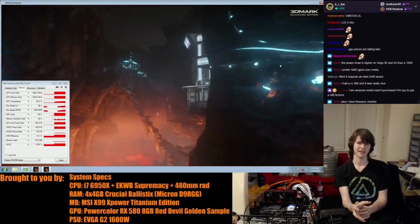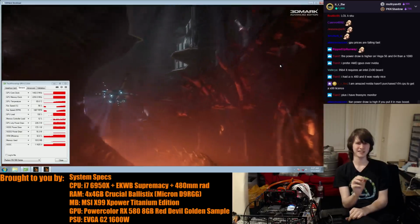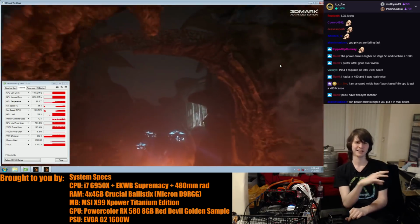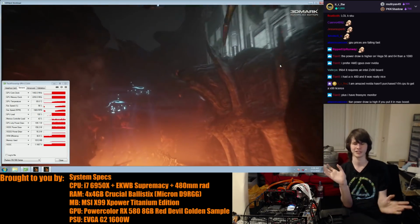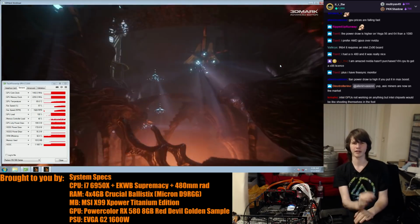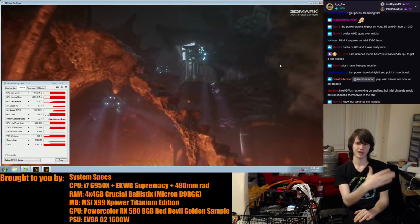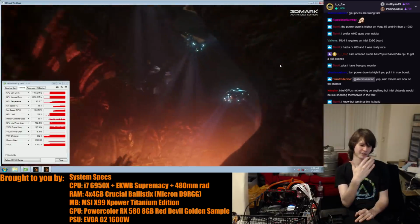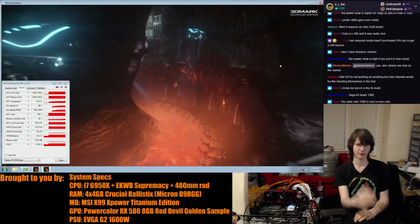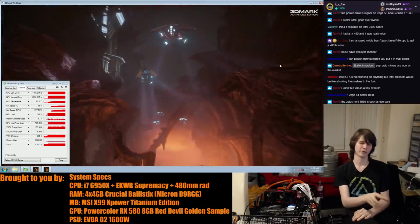And then even the sockets: Intel CPU sockets get dedicated pins for voltages like VCC PLL_OC. That voltage doesn't need to exist from Intel's perspective. If they didn't care about overclocking, that voltage doesn't need to be a thing at all. But Intel's like, yeah, we're gonna support extreme overclocking, so they made that voltage a thing. Because if you're on liquid nitrogen and you don't have that voltage, you get Kaby Lake cold bugs and Skylake cold bugs and Coffee Lake cold bugs at -120. If you crank that voltage way up, you can go down to full pot. Intel will actually put in the work to make that a thing, and if a motherboard vendor wants to support that, they can.